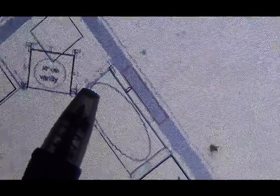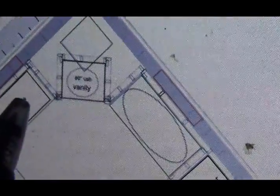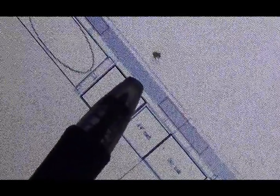You kind of want a window for good lighting and ventilation. I want the drain for this real close to that. These drain lines are like 18 inches, 24 inches off the ground — your standard sink drains. So plenty of slope there. And the washer drain is like two foot, maybe 30 inches off the ground — plenty of slope right there.